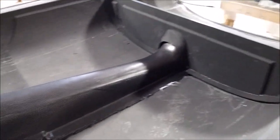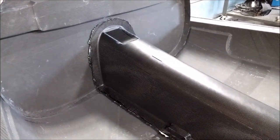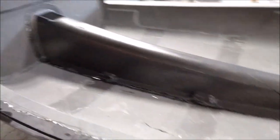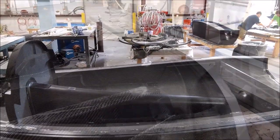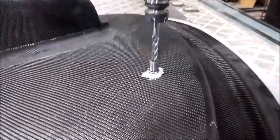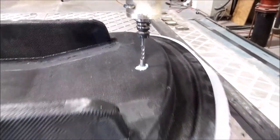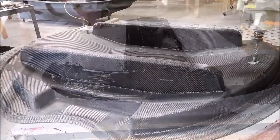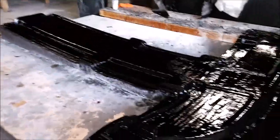There's the keel popped out this morning — rough, not even trimmed yet, just sort of put in place. Once it's all trimmed off it'll fit nicely, but it's sitting fairly well in there even without the trim work done, so we're pretty happy with that. You can really see we're starting to put together all the parts of the fuselage now. The drill bushing work is going on again on the aft bulkhead — four of those to go on, one on either side for the upper gear mounting and one on either side for the lower.